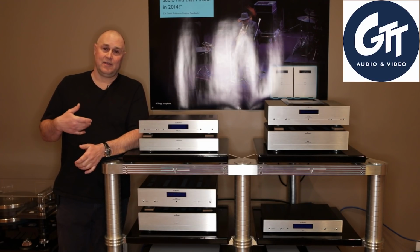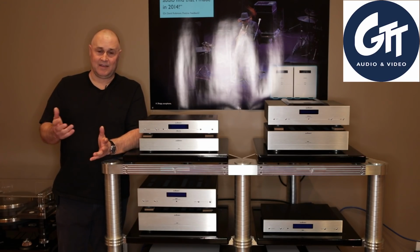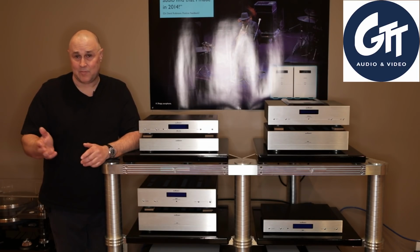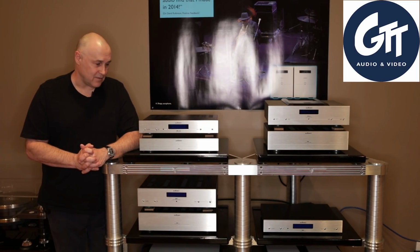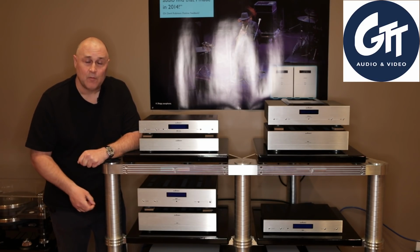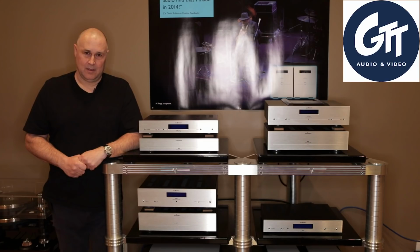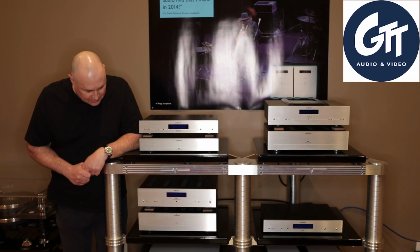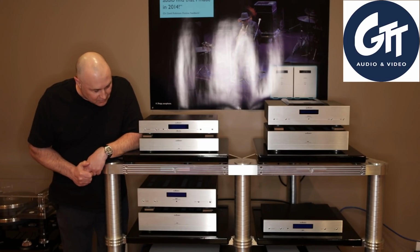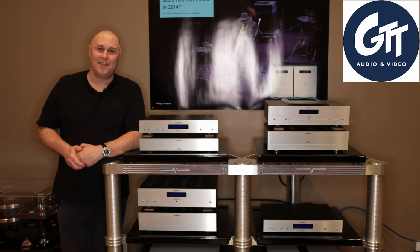It's your analog setup. It can have a phono stage input. It's your DAC. It is all in one. You take this, add a set of amplifiers or powered speakers, and you've got a system. Again, bandwidth out to 1 million, or 1 meg. Again, that 24 ohm output impedance. One of the best slew rates in the industry. The rise time, the start-stop, what really controls those amplifiers. It's all there. So that's these two.